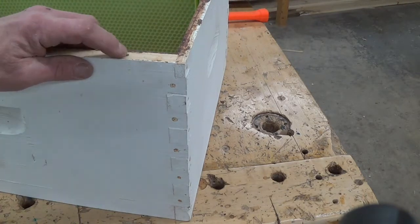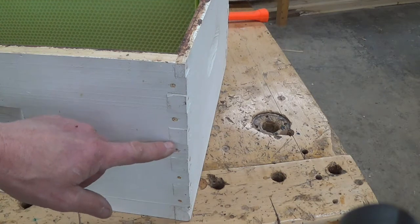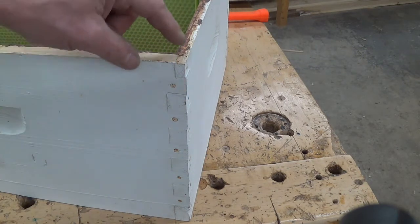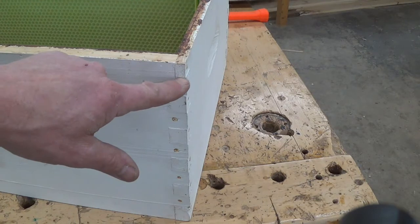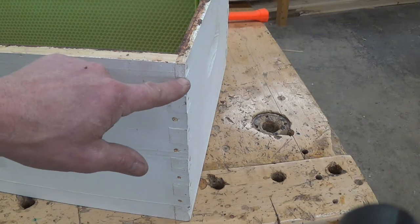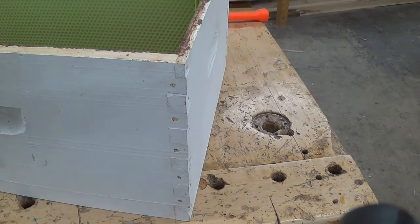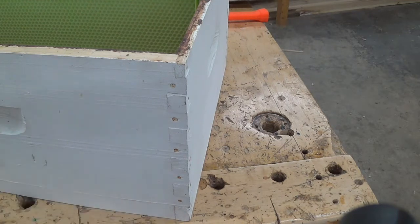I want to talk a little bit about what a bee box joint is and how it's different from a standard box joint. All bee box joints are 7/8 of an inch wide — it doesn't matter whether it's a shallow, medium, or deep box. There's a special cut at the top because of the rabbet, so this joint is only 5/8 of an inch instead of 7/8. We start by cutting down our first peg, and the full-size peg underneath is 7/8 by 7/8. At the bottom, it's always a random number — no bee box comes out perfect. Leave a bigger tab for the bottom; don't leave a little sliver.